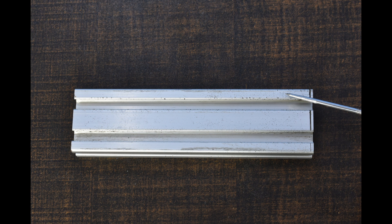That's rust — but many of you will say that's poppy talk, aluminum doesn't rust, and you would be right that aluminum does not rust under normal conditions. But once aluminum is introduced to salts, it will rust. So here's my theory about what happened — and this is a theory, it can be wrong. When the EDM process began, it chipped off some of the anodizing agent on top of these extrusions. That anodizing agent contained some form of oxidants which further reacted with other anodizing agents and the reaction became self-sustaining. Another theory is that the deionized water used for cutting these extrusions was not fully deionized. Other than that, nothing makes sense — I would love to hear your thoughts about it.